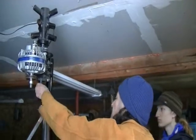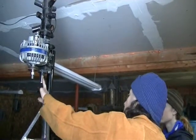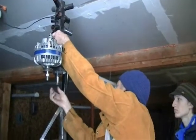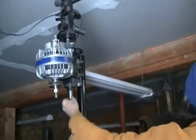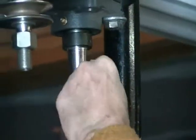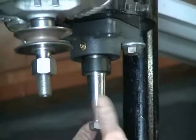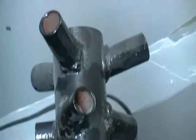Now we have to order in a pulley, and you've got to put this tapered shape on the pulley. So I threaded both ends of this shaft, so you can put a bolt in there. You could have left it a little bit longer and threaded it for a nut. Now I'm putting bolts in the end. It's easier because you're just drilling and then tapping with the thread.